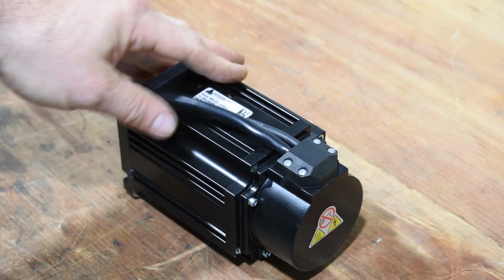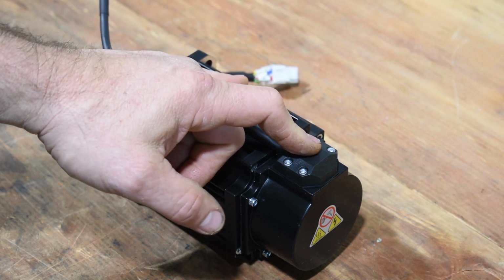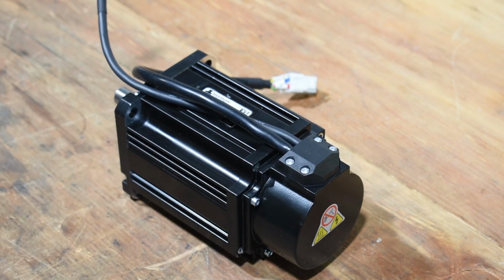So in that case, and I'm going to be using Centroid, I'm going to depend on this encoder to let the system know that it's missed a step, versus the actual software. And that's why, if you look at the Heidenhain Bridgeports and the Heidenhain controls, they don't have encoders on their motors. They rely on optical scales or magnetic scales on the machine, similar to your Acurite products, similar to your Mitutoyo. So what happens is they're working to get from point A to B, and the actual scale on the machine is letting them know that that's exactly where they are. So they don't go by anything else, but by the complete actuality of the state of the machine itself. That would probably be the best outcome, and I'm sure a lot of the high-end machines are like that.